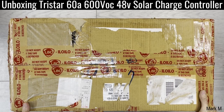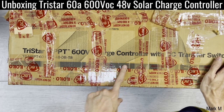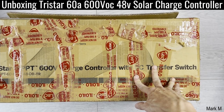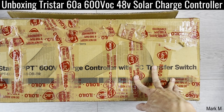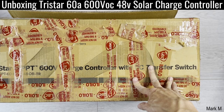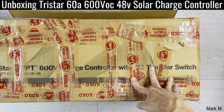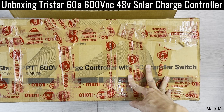This one is from the Morningstar Tristar family. This is the Tristar MPPT 600 volts charge controller with DC transfer switch. This is basically a game changer for those who are looking for a single line connection — say a single PV string — and you have an off-grid and a GTI or inverter. What will happen is Tristar will take control of your PV. Depending on the situation, during the day the PV will be redirected to your grid-tie while your battery off-grid is being charged by the grid. This one in conjunction with grid-tie and an off-grid is best of both worlds.